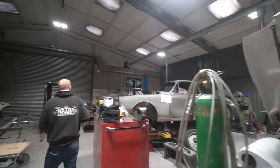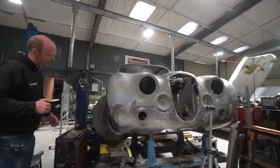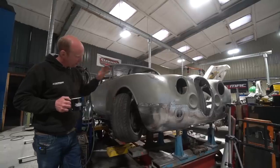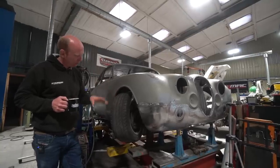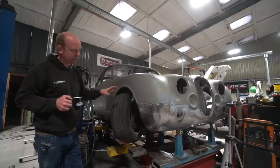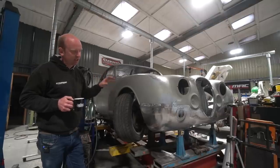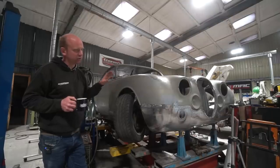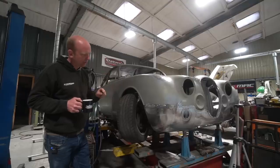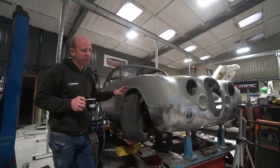Churchill. Very happily for George and me - we kind of co-conceived the suspension plan, and it works. Briefly recapping: we wanted to redesign the front suspension. We had done a redesign of the steering on a Mark II Jag for a previous project and were reasonably happy with it, but there are still significant limitations on the geometry given the constraints of working with the Mark II Jaguar wishbones, uprights and crossmember. On this, having chased our tails for a little while in that same circle, we decided to totally abandon the plan of using any of those parts and fabricate our own crossmember using alternative parts.